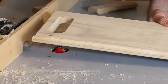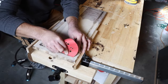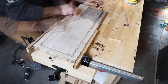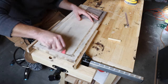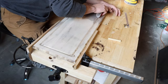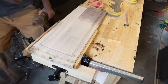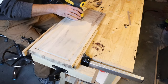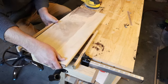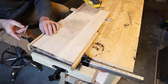Now I am dropping this onto my router bit before I turn the router on — don't try and drop this down onto a moving router. And now I just have an 80-grit on my random orbit sander. I just have a wooden dowel that fits into that groove, and I'm doing everything the same as I am with the rest of the board. I start off with 80 grit inside there, then switch to 100 or 110, and then finish with a 220. You're not putting any pressure on the sandpaper or the sander — just let the sander do all the work. I have it set at about three out of six, so half speed.